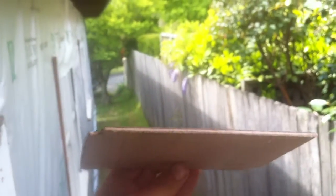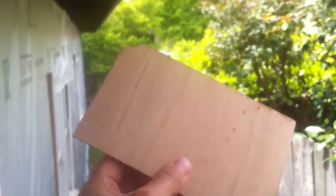We looked at a range of possible materials for relining these eaves. The most common thing to use on houses these days would be fiber cement board, but it has to be painted and the client, who happens to be my mother, is very keen on avoiding paint on the outside of the building wherever possible. So we've settled on this very thin type of hardwood bracing plywood. The nice thing about it is that we can stain it so it doesn't have to be painted, and it'll slot very nicely into that groove.